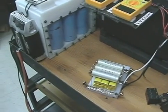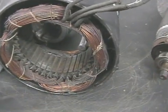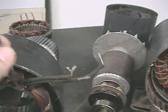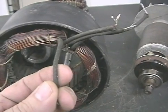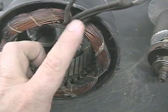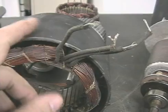That is basically an induction generator. I wanted to throw this in for your benefit: if any of you are planning on rebuilding one of these motors, this motor had old-style cloth wires on it. If you're taking apart any of these old 1940s, 50s, or 60s motors, you might have run into this wrapping that's brittle — it falls apart and causes a dead short to the casing, which is why most of these motors end up in the junk.